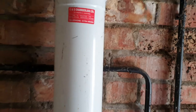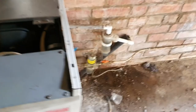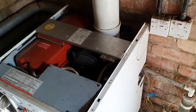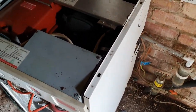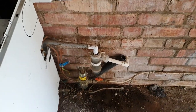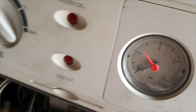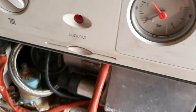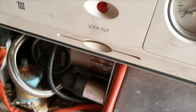It's just a full service - strip it all out, take the baffles out. You can normally tell with an oil boiler straight away if it's burning right because there should be a little bit of red left in the bottom rather than all blacked up. I'll clean the condense trap out as well and try to get it going. I'm just pressurizing the heating system back up now. Pressure on that should be at one bar - there is a low pressure switch on these but one bar is good.